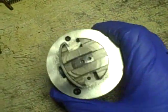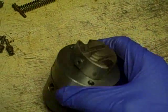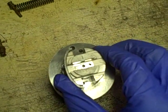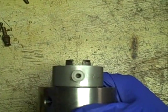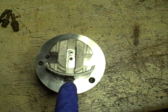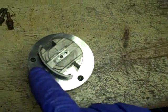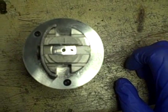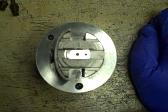Now let's look at this head assembly. It appears this screw has to be removed to get it apart. That screw is your max fuel adjustment. But it's not something you can just unscrew carelessly — turning it even a small amount actually changes the dimension on this component. I don't remember exactly where the dimension is measured, but I do remember reading that it can be checked with a simple two-inch micrometer.